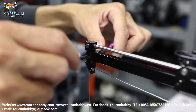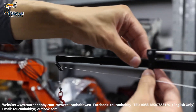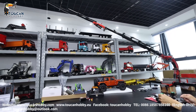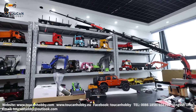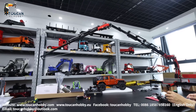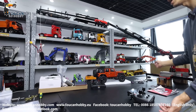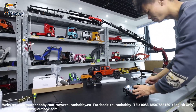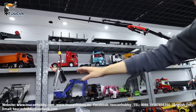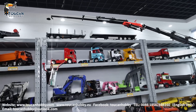There are still two more sections for manual extension. Here we can bond strap and secure the screw. I have two more strokes — secure the screw again. With all arms reaching out, you can operate the big arm going up with 300 grams — that's the maximum load. The big arm can move, but the middle arm doesn't have enough power, so only rising up with the big arm and front arm.